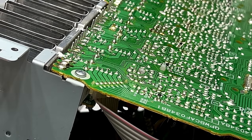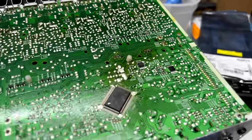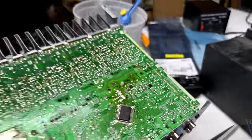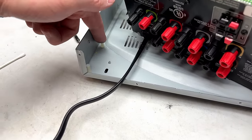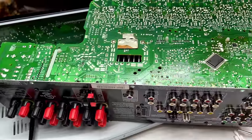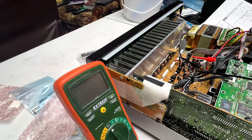Should be all over but the soldering now and the idle current adjustment of course. I'm going to fold the leads down so I can solder them, and we've got to watch because there was one that was almost shorting out on another trace — watch for that when doing this kind of work. This is really going to go through the solder but I've got lots. All right, so that one's done. I'll go off-camera now and finish up the rest of these. You can see there's a bit of a heat-damaged area on the circuit board — another thing to watch for with these receivers. I've already done this section but I might go over it again, and some of the standoffs I cut to get in here actually didn't need to be cut — a lot of them are just flat tops; only the ones further towards the middle have clips on them.